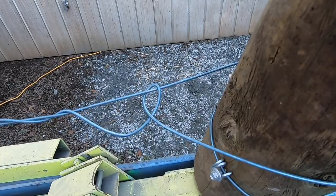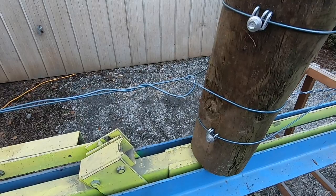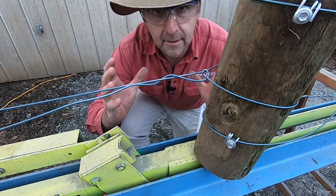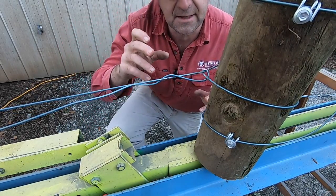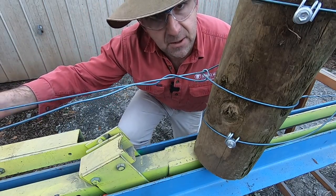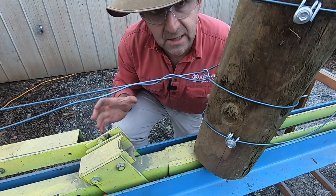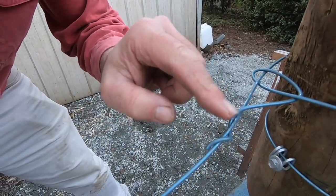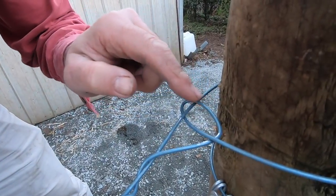There's a fair bit of take-up happening there — and that's a negative for fencing. It's actually, as you can see, slid down the wire. It's undone. This fence, if it was hit by something and tied that badly, would just lose all tension. Here's our second iteration of the sloppy knot. You'll see that I've finished off the pigtail a little bit better, but I've still left ample room. Let's see if it suffers from the same fate — tightening up, tightening up, and just slipping, slipping, slipping. It's not actually stronger. What it's actually doing is allowing the wire on the fence to get a lot slacker before it actually takes up any tension, and then I predict it will break at the same pressure anyway.